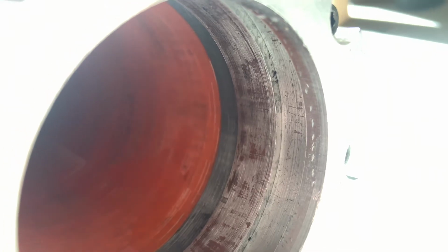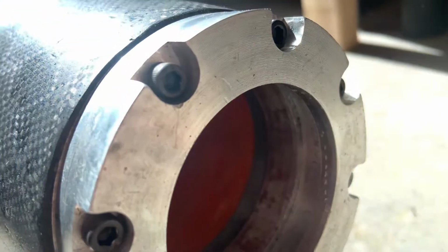For Blackout, we chose to use an M-Class 75mm 6-grain Cesaroni M2020 motor. This motor provided sufficient force to reach the required off-the-rail velocity and the impulse to reach the targeted altitude of 10,000 feet. To secure the motor in the rocket, we made our own custom motor retainer consisting of 2 machined aluminum 6061 components, the thrust ring and a separate retainer piece. The ring is used to transfer load into the airframe, and the retainer piece prevents the motor from falling out.